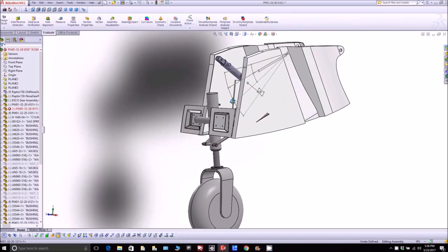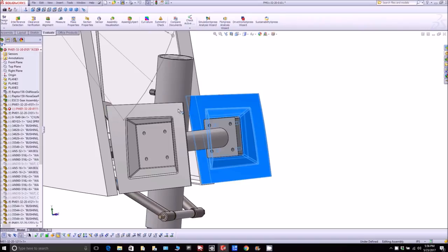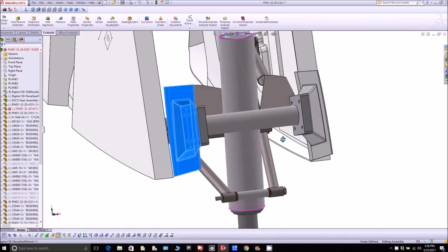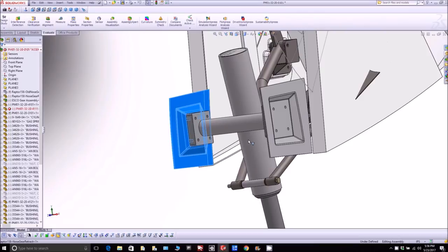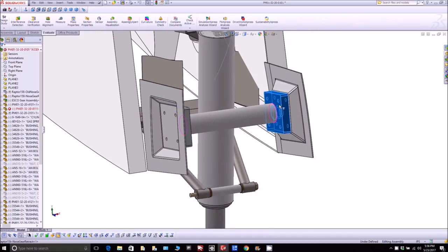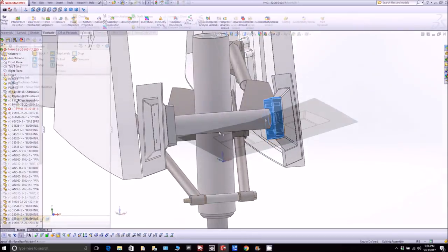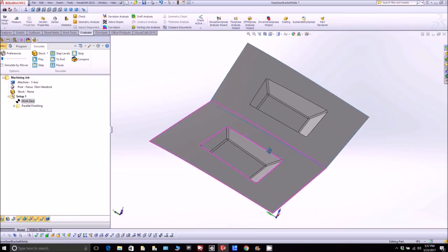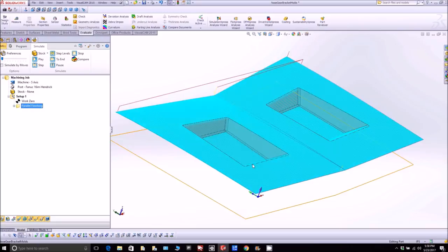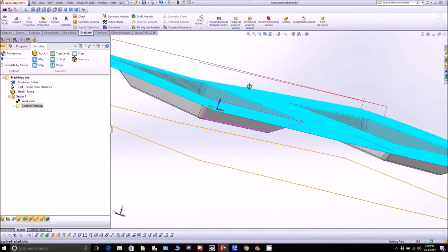Still on the nose gear — the next thing we had to do is create these little standoff brackets, similar to what we did with the rear main gear. This is for the main attachment point for the nose gear, which basically lives in the keel. The ones highlighted in blue need to be created out of carbon fiber with a little bit of FR4 to add a mounting block. The other blocks highlighted are aluminum 6061 and have been sent off to be milled at Preferred. Jeff suggested the best way to make these standoffs is to create a quick little mold out of MDF.